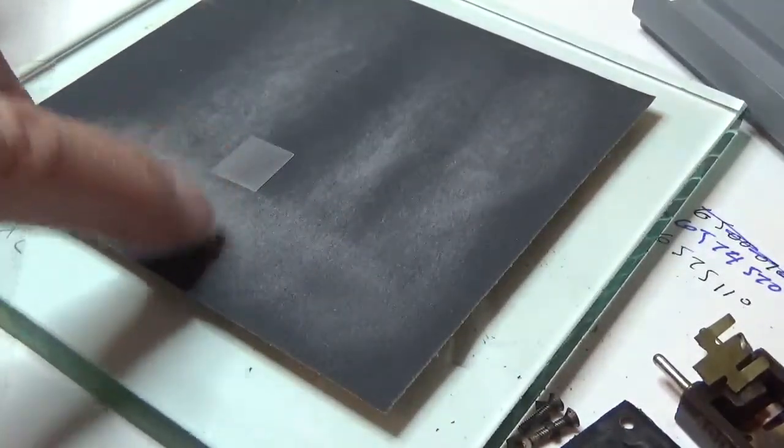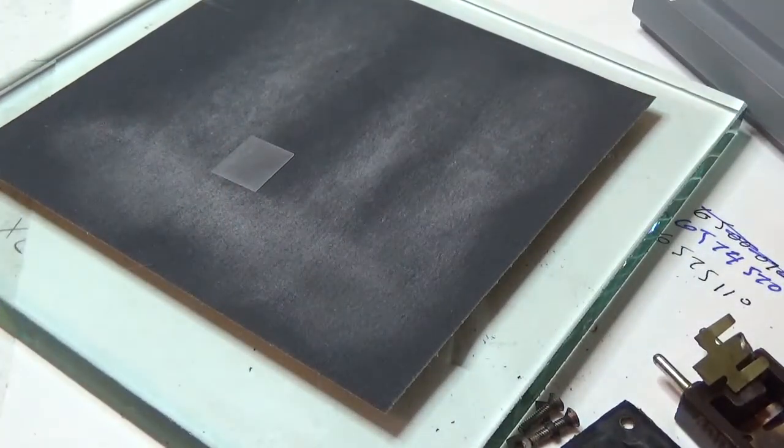Now you can see the quartz is left on the plate. But you can't just go and put it on the plate and measure it because of all that quartz dust that's actually still on that crystal. So the step that you have to do is clean it before you try to measure it again.